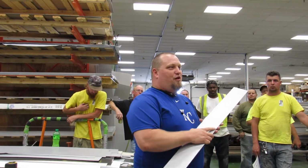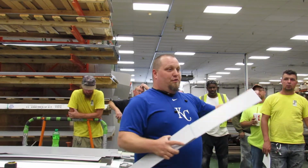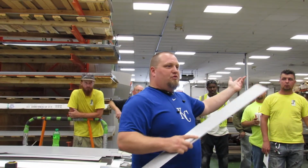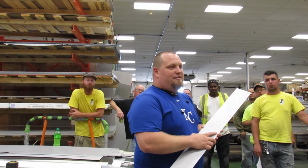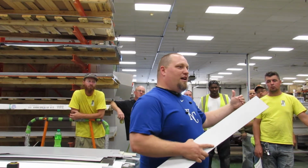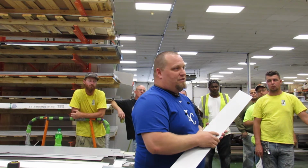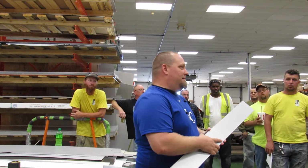We were at ATSU on the roof, and there was an extrusion of extruded sill metal in place, and we took it off because there was a water issue. We were trying to find it. We took it off, set it on the roof, and it took 4 of us to get that thing back in place because it got so hot and grew enough that we couldn't get it in place. We had to lift up and bow it into place. It was so tight. It was the first time I was able to physically see how much this stuff does move.